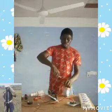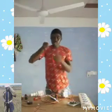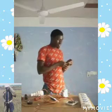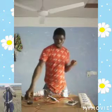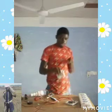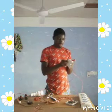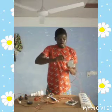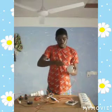We take our neutral from one side of the neutral cable. As I said earlier, you try to remove the demarcation. You connect it to the N terminal of your RCCB breaker. Screw it in — make sure that it is all tight.